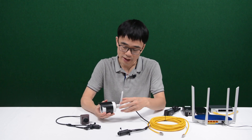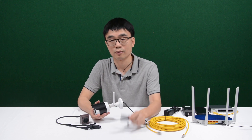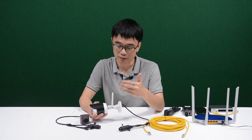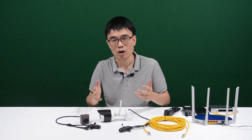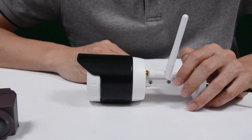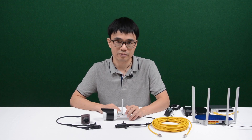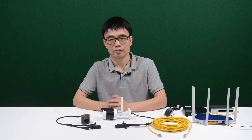And there are two methods to work with the camera. This is the Wi-Fi camera, but it also supports wire. So we can either use the Wi-Fi connectivity or the wire connection. My advice is always use the wired connection if running a cable from the router to the camera is possible. When we use Wi-Fi to connect the camera, we need to have strong Wi-Fi coverage and stable connectivity.